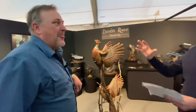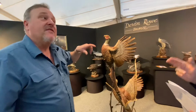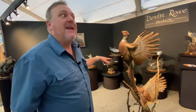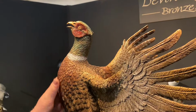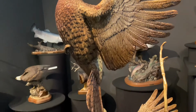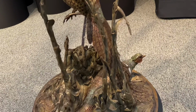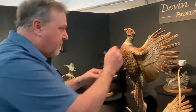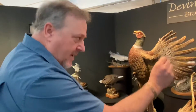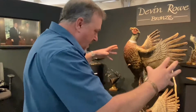So when the bronze comes out of that mold, everything's welded back together and sandblasted, and the colors are different acids and different consistencies of heat. That was my next question. Makes the colors. So you've got this kind of rough, crude bronze piece that you finesse. Then you're sandblasting. You're going in and etching, like you said, with metal tools. And at what point are those acids used to make the colors? Once all the weld marks are basically gone from welding the pieces back together. And everything's etched back in by hand. I'll look and make sure everything looks perfect. Then we'll basically rub ferric nitrate on it, and that makes the browns and colors, and then we go from there.